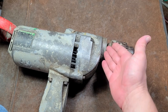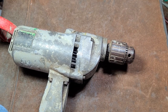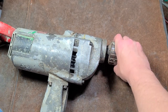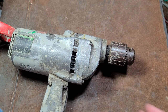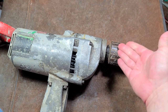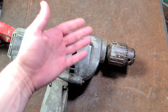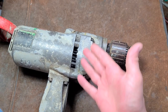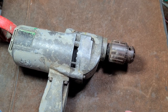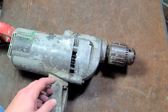The big deal about this is the large bearings, three-quarter-inch very heavy-duty spindle — it won't bend when you have large bits like post-hole augers in them — and very large, heavy-duty gears that can take heavy-duty loads for a long period of time. Still super smooth gears — triple reduction — you can easily turn it by hand, but just to give you an idea of the amount of moving mass involved, it's substantial even holding on to the chuck. It's actually not too loud, which is one of the nice things about Milwaukee: they did pay attention to their fans so they aren't just absolutely screaming in your ear when you're running them.